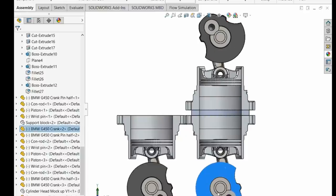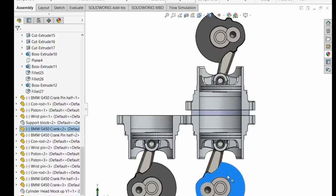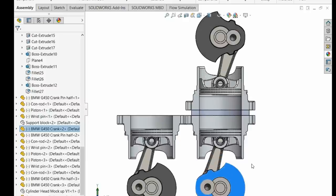It doesn't mean that these can't be throttled. What it means is that because of the... It's like two strokes, right? Two strokes, you have to go through all that resonance and stuff and power valves. Variable exhausts for two strokes were abandoned in the wake of the power valve. That's basically what the power valve is. It's almost like a variable length exhaust is a power valve. That helped with making it throttleable.